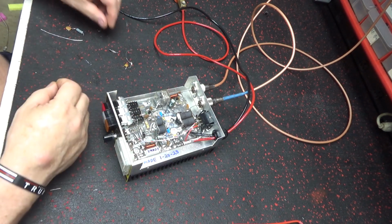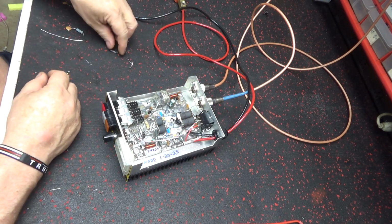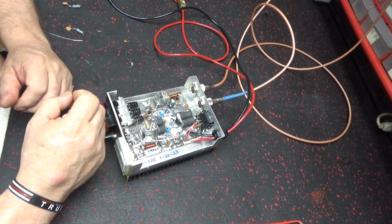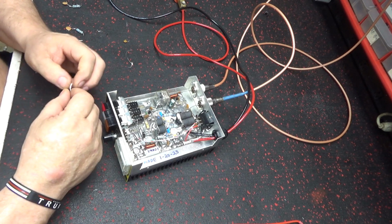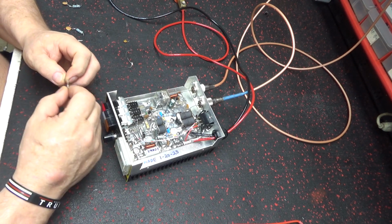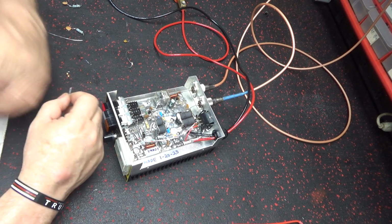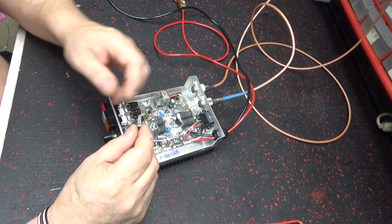That was a 10 ohm that was blowed. That was the 331. I ended up texting Gatekeeper and I said, dude, I got one oscillating. What could be the problem? He said, it's probably an easy fix. Change the key-up circuit. Well, I got thinking. I said, well, hell, is that a key-up circuit? I mean, it was keying and unkeying with this one.